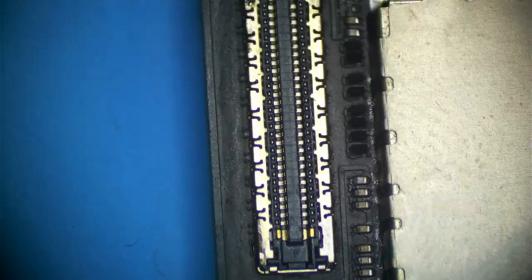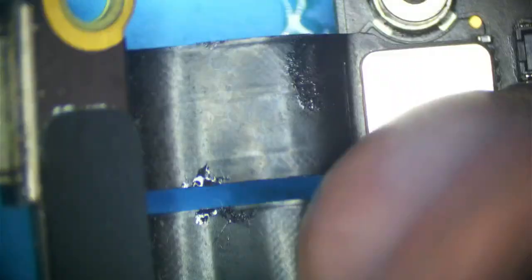So that looks better. The internal pins look all right. Let's give it a shot. The board will work fine without these capacitors here. These are just mainly protection, stuff for protection, ESD protection, things like that. Which, again, we're going to care about ESD if we're long-term use, but not if we are short-term use. Whatever works. Does this side work? Because I'm most concerned about the ports that I worked on.